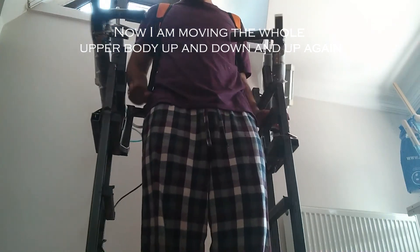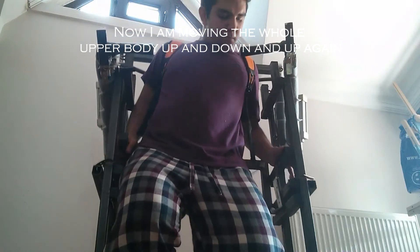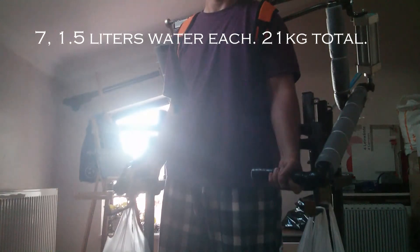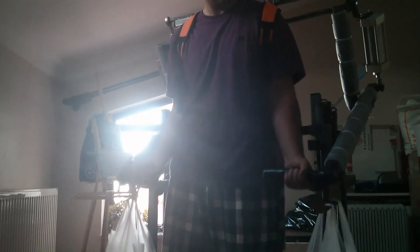It also has two pneumatics — they are just like hydraulics but work with air pressure. Hydraulics are better, but they are more expensive and I had financial limits. These pneumatics can press 187 kilograms, and when we involve the math and physics — which I explained in my other video, link in the description — I can lift 84 kilograms net weight with it, not counting my own arm lifting power.